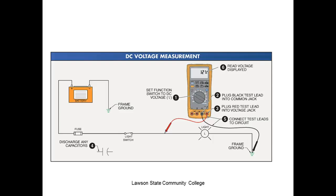You take the black lead and hook it up to your circuit common, and then do what? Probe with one lead. But you can probe inside the circuit if you want to, right? You understand? So with a voltmeter, you don't have to probe relative to circuit common. And if you're doing AC, guys, the black lead and the red lead mean nothing. Y'all understand?